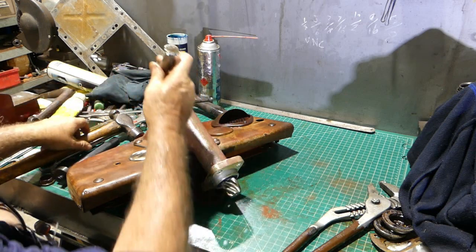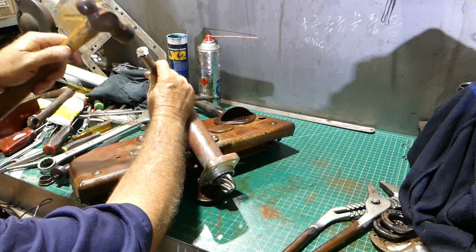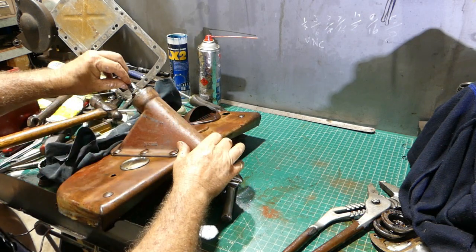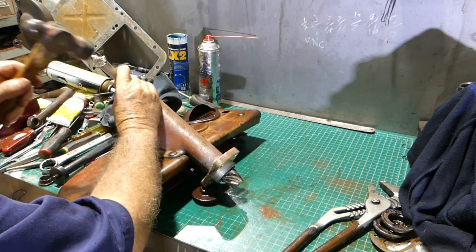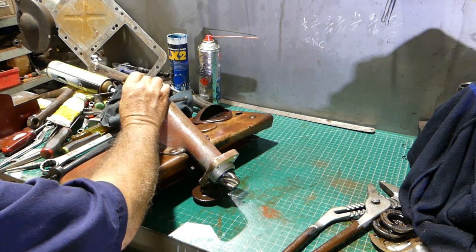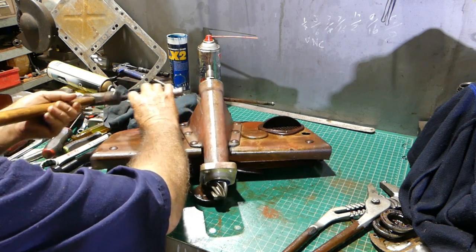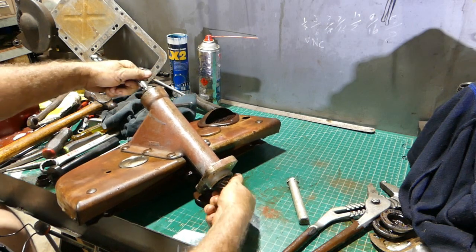So we'll knock the lock tabs down — that's that one, now we need one coming back the other way — so they can't come off anywhere. Now this little Woodruff key — we could probably put it in. Just bumping it in with an alloy punch. It's sitting there — not hard to turn, doesn't flop over on its own but that's certainly fine.